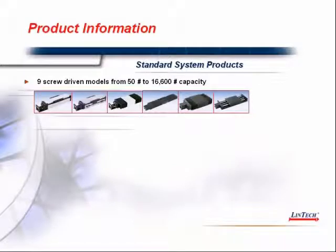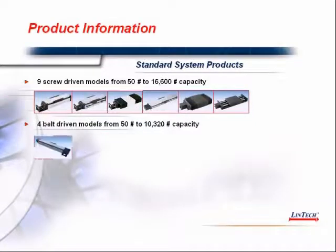For higher accuracy applications, Lintech can provide the 150, 200, or 250 series. They offer straightness and flatness of less than 5/10,000ths per foot. These three series offer excellent load capacity in a very compact package.